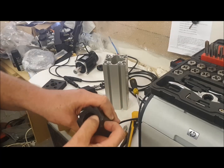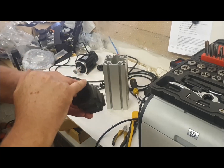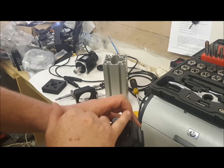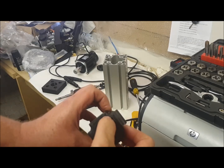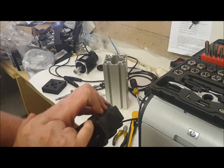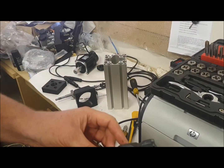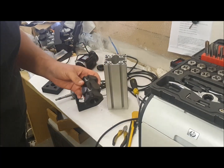This is one of the things I'm looking at to maybe improve the design of. I think what they've done is tried to get the profile to follow the inner part, and the problem with that is there's no margin for error. So I'm thinking of taking the flat in the bottom of the groove and moving it further inboard or making it a radius, so that I'm only running on the side flats. I think that'll give a better chance of matching that shape properly.